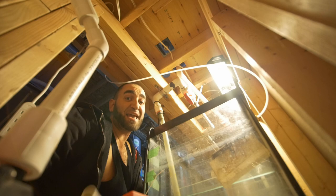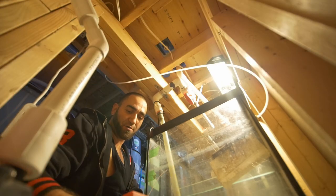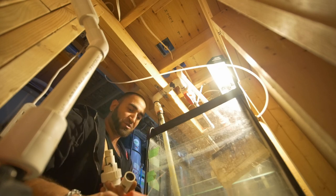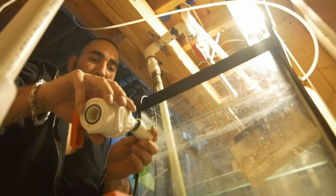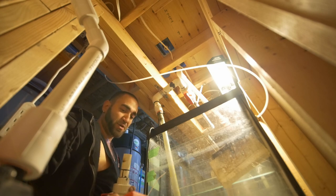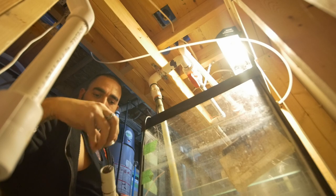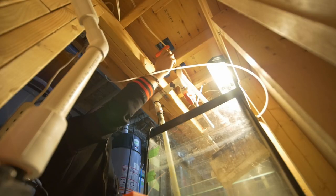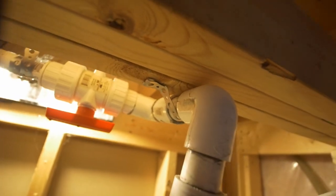I'm back on the right side of the tank, ready to install the coupling along with this valve underneath on the return line. I have my PVC glue all ready to go. I'm curious - do you guys use PVC primer, or have you been using just the glue like me? Many people have different opinions on that. So I've installed this end and now I'll install up at the top. You definitely don't want to get any of this glue in your eyes, so it might be a good idea to put some gloves on.